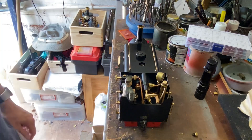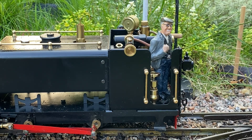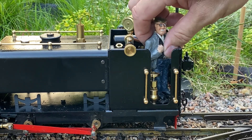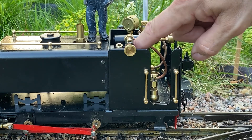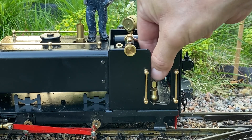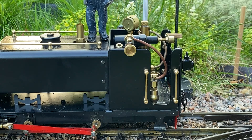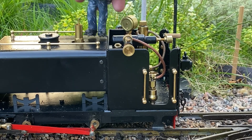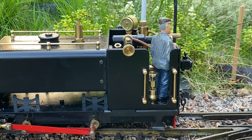End of part one. Now it's a little later in the day, and we'll just pop the thread once more on top of his boiler - another pressure, the safety valve about to lift. There's no steam leaking here. I've put a fibre washer at the back and a smaller neoprene on the front. I'm now going to open the globe valve, and there's some water coming out - so that's working perfectly. Pressure gauge is up to 60psi, safety valve is lifting, and let's see how many circuits we can put in this time.